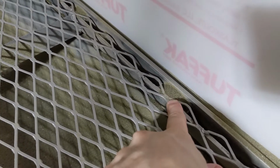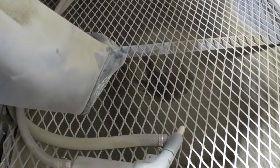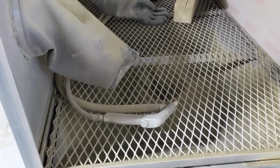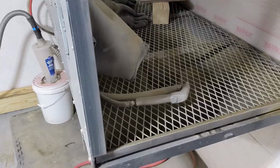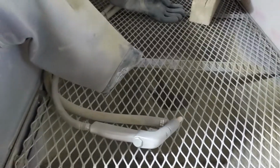And as you can see here, there's a wheel here, but you can't see it because it's covered with coal slag. That's the other problem with the sliding tray. As you use it, all of the mechanisms for it actually sliding get caked up with stuff, and then it no longer slides. So it's a good idea in theory, but in practice it was a huge waste of engineering effort because it doesn't actually work. So I would just go with a static floor, probably two panels, one on each side that you could remove as needed.